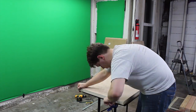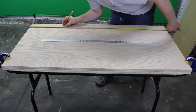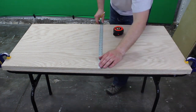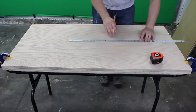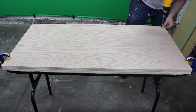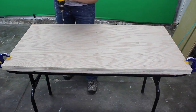Clamp the two pieces together to make sure at least one corner is nice and plumb, then use that one corner to base the rest of our pieces off. I wanted the added security of having screws, so I laid out a grid on the top itself on the first half, since I'm only able to do two pieces together. I did it in half at the 24-inch mark, then measured out a foot in each direction to get the edge. I do it every six inches using the width of the ruler to get a grid around the outside. It's very important to countersink each screw head — drilling a countersink hole at each grid intersection. There are about 25 screws used for each half.